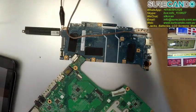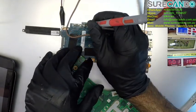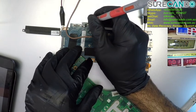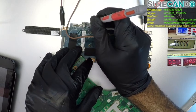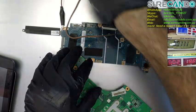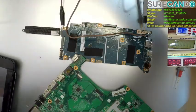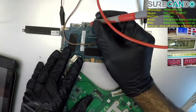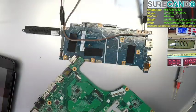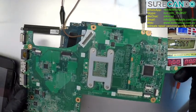Okay. Okay, maybe this part only turns on when there is power. And let's just check continuity mode. Which part is ground? So top part is ground, power is here. Probably comes from the MOSFETs. Okay. And I'm assuming that may have something to do with the backlight, so it's probably a high voltage.